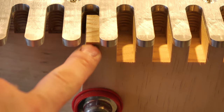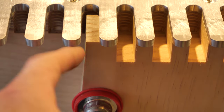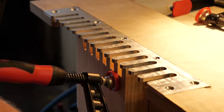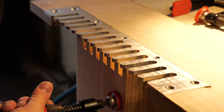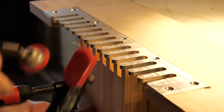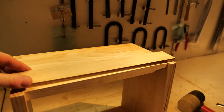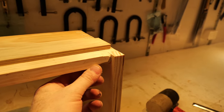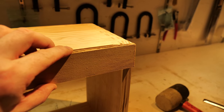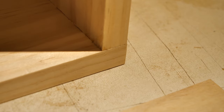Let's go ahead and cut all of them. On the top front corner of the ends, just leave that one untouched — you've got to put the notch in there for the front but you can leave it for now. There are the pieces. We've got to put our little notches in for the front panels, top and bottom. There's a bit of breakout but it's going to be behind the panel anyway and supported by the end, so no real strength compromises. The rear joins are nice and flush and everything lines up.